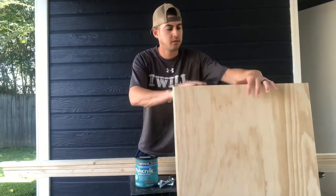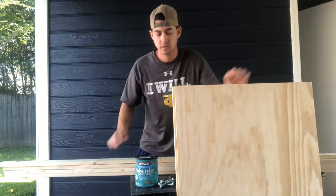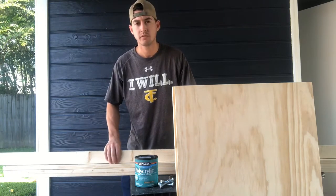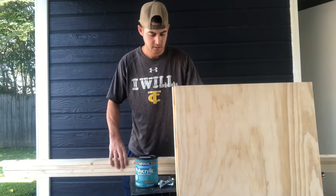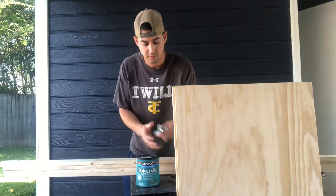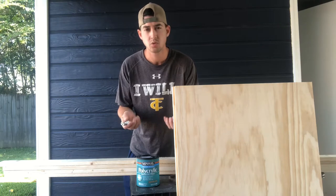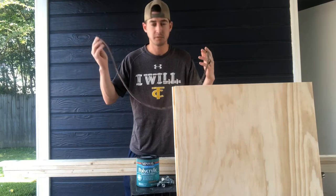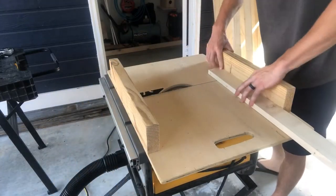Here are some of the materials we're going to use today: two 2x4 foot sections of 3/4 inch plywood, four 1x3 by 8 foot long pieces of pine, some polycrylic — it's just a water-based clear coat — four carriage bolts with nuts and washers, two washers for each carriage bolt so eight total washers, and an approximate four foot piece of rope. I'll leave a cut list down in the description for anyone who may be interested.